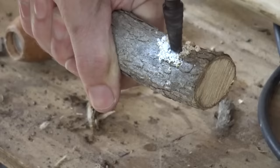Okay, our sanding is pretty good. So now I want to get all the burrs, all the sand, rough edges off. So I'm going to use some denatured alcohol. I'm going to grab a rag. This will probably raise the grain up a little bit, but it'll dry pretty quick. Just like that. Just kind of let it sit there for a sec until it sets up. Okay. Now I just kind of let it settle into all the little grooves there.